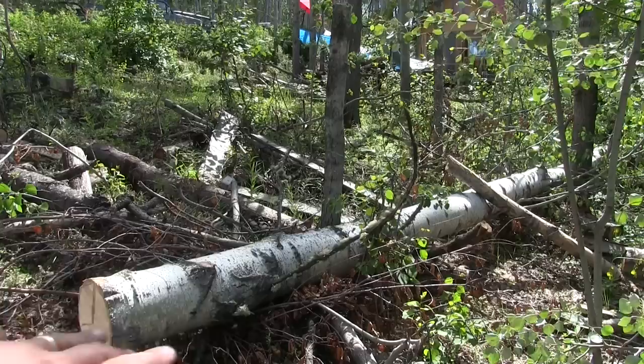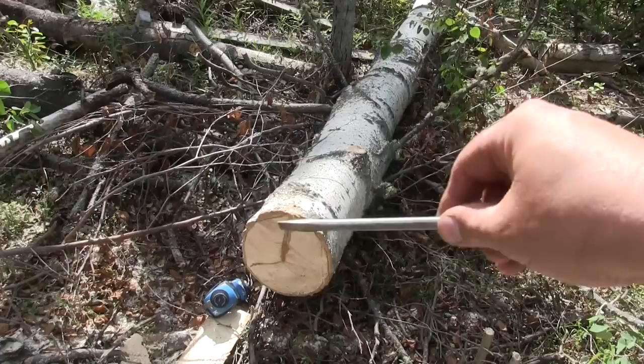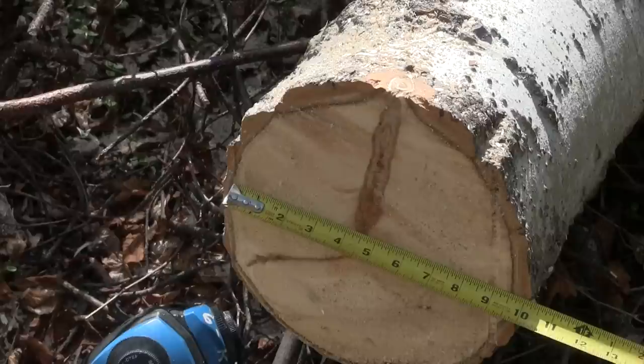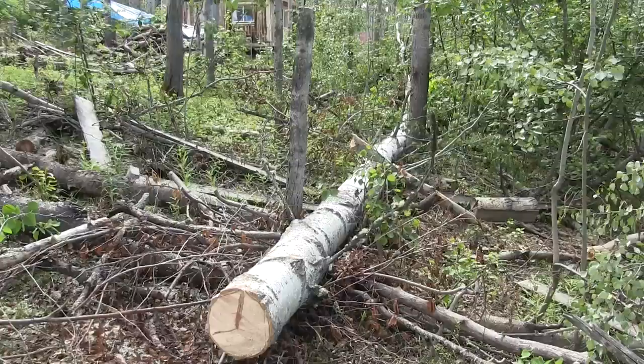You just use the saw to trim off the side of the log you're cutting. Take this log right here — first thing I want to do is roll it towards the straightest side so when I take the two sides off I can get two even cuts, one on each side. I also need to know how wide of a two-sided log I can cut out of this piece of timber. Getting down and measuring to the inside of the bark, this is nine and a half inches, so I can probably get an eight-inch cut out of this log. That will leave me about four inches of flat on each side. I don't really want to use my six-inch jig because it's a good-sized log and I think I can get an eight out of it.